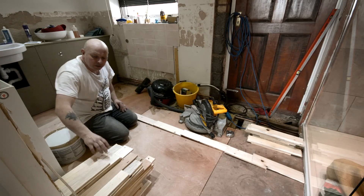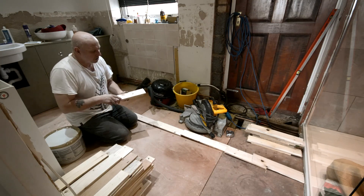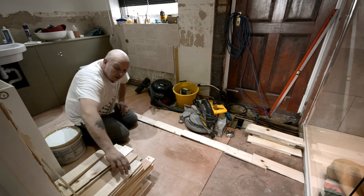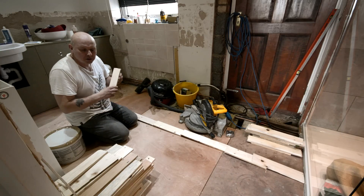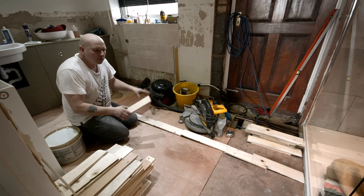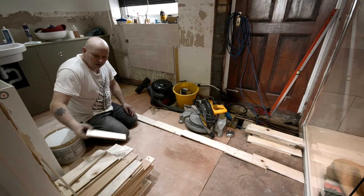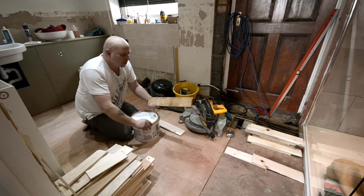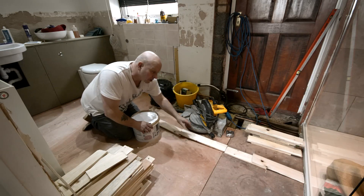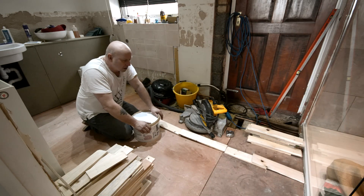All these are going to be different sizes. I've got one lot of wide boards — say wide, about four inches or 100mm — and about three times as many narrow ones as wide ones, so I'm going to try and put the odd wide one in there. Although I kept these in the dry for as many months as I could, they're still not seasoned. It's all pallet wood, so I'm not going to season it — it's not decent hardwood, it's not going to be joinery.